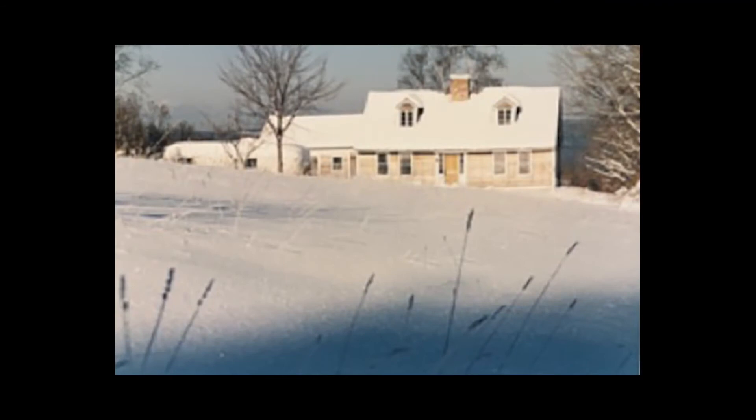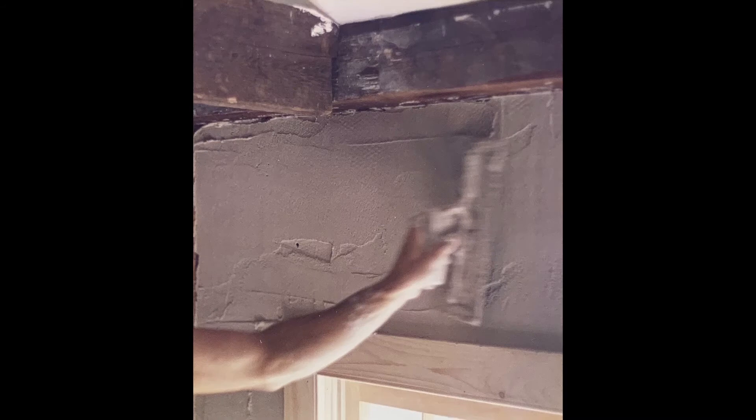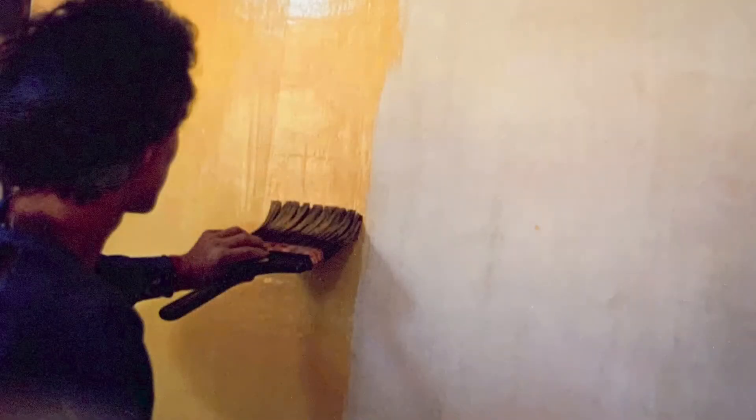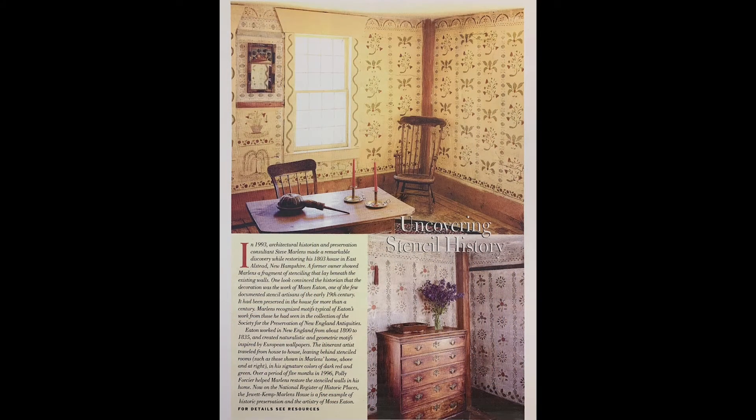This is the Jewett-Marlins House in Alstead, New Hampshire, 1996. Historic houses are usually called by two names: the first indicates the original owner and the second the present owner. Steve Marlins, an architectural historian, discovered that wallboard walls covered the original walls — in peeking behind, he found Moses Eaton stenciling, which he exposed. One whole wall was gone and he wanted that replaced, and the damage to other walls repaired to match the remaining walls in good condition. The first job was to replace the wall and then match the original background paint. He ordered several strong shades of yellow milk paint — we were quite sure we had it with a bright school bus yellow, but it was still wrong. In a flash of brilliance, Steve scooped up a handful of 200-year-old soot and dirt and rubbed it over the new paint. Voilà! The new wall was such a perfect match that the magazine photographer mistakenly used it as an example of the original wall.